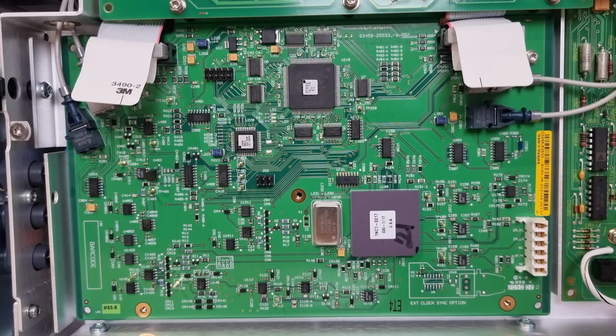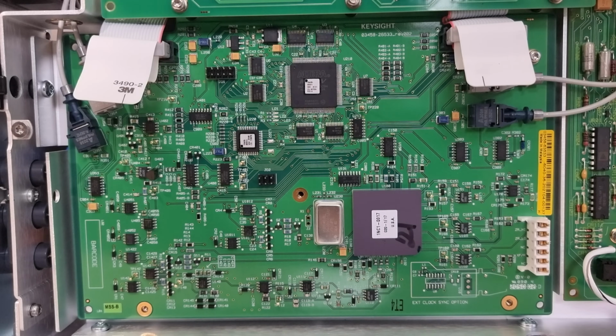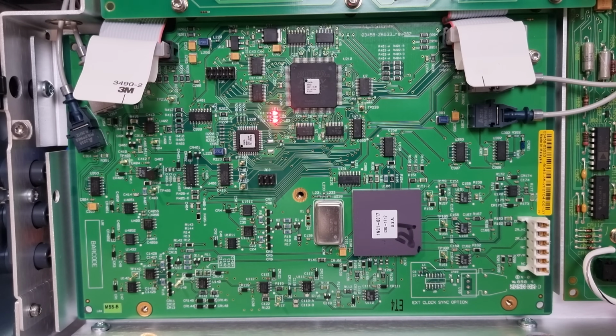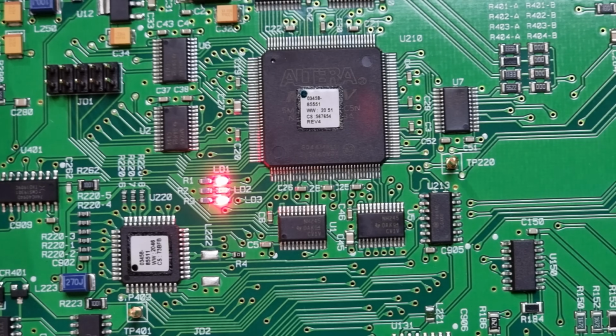None of this strikes me as an obvious contributor to temperature coefficient, but then again we are looking for only half a ppm per Celsius. Anything could cause such a small effect. Who knows, maybe even the addition of some decorative blinking lights, whose state corresponds to ADC cycles. Here's one conversion per NPLC, for example.